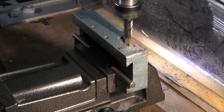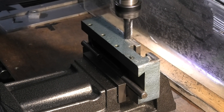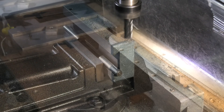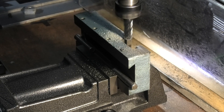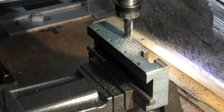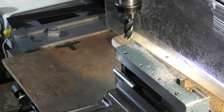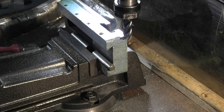I've put in a 12mm end mill and I just want to mill a nice surface along this edge. The milling cutter is just touching on each end, so that shows that when the casting was originally machined it was set true to the raw casting. The castings have a white filler on them and then painted over the top, so as I get through you can see the white filler underneath the paint. I've only taken about 20 thou off the top of that casting — most of that is filler and paint. I've put a little bit of oil on, not to help the tool cut, just to get a better finish on the final cut.